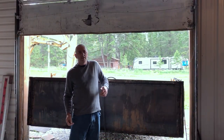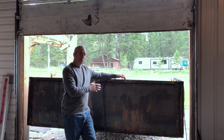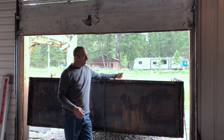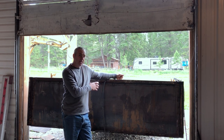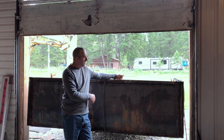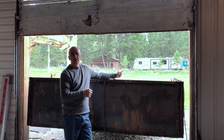I've been working pretty hard and I've got the transom welded in. This used to be the front of the boat — I cut the whole front off, it was too long, so I had to cap this end. This becomes the back of the boat. I welded in a sheet of 1/8 plate all the way around, and now I'm going to spin it around and do the front.